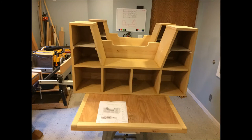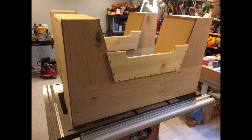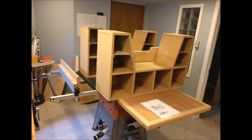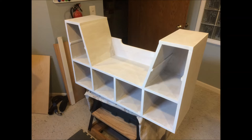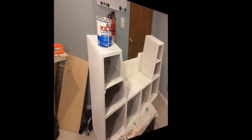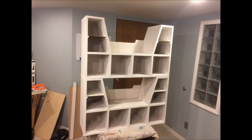Here are a few photos running through the finished state. I sanded it all down, then filled all the screw holes with wood putty - had to fill them a couple of times since I made them kind of deep on purpose to make sure they filled and wouldn't come out. After sanding, I put a coat of primer on it - I used Kilz primer I had, a latex wood primer. It came out pretty well. This is basically the final product - it still needs to be painted, which will happen in the near future. If I get it done I'll post some final pictures.